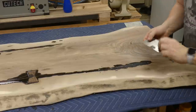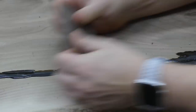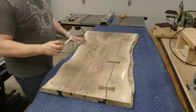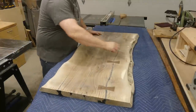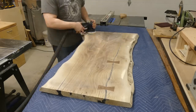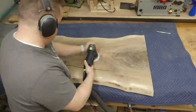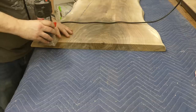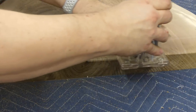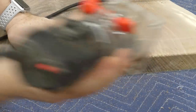This is actually after the second pour and I'm cleaning up my top layers with a card scraper. I ended up giving up on that and just cleaning it up with the Festool sander on Rotex mode. Now that I have it pretty flat I'm going to higher grit, just marking with a pencil so I only take off the top layer. I used a round-over bit on the edges, and then I'll sand the epoxy with much higher-grit sandpaper — that helps to leave it smooth with no sanding lines.